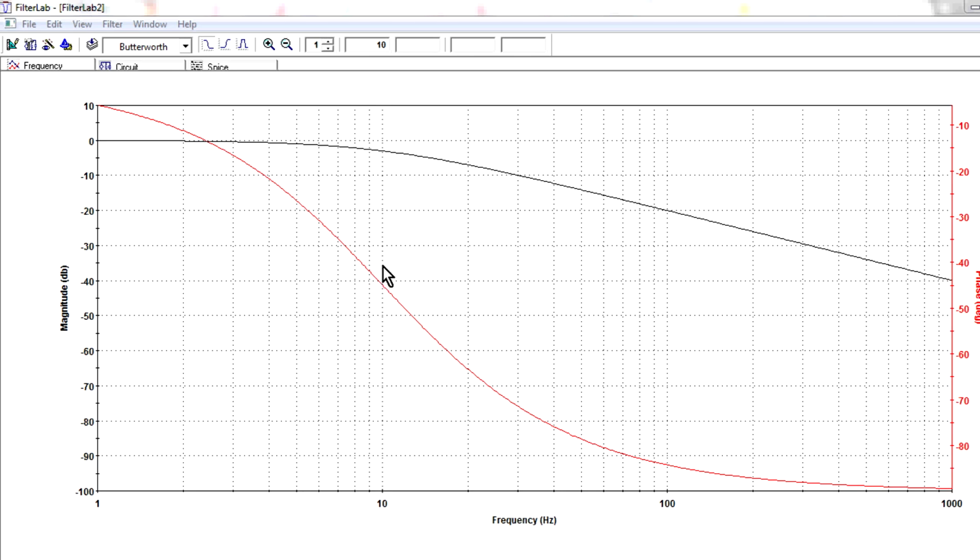It gets more complicated when you start talking about a PWM signal, and in practice it's actually going to be lower than that. But let's use a ballpark. Let's say you did actually get 1 millivolt of ripple out. Assuming it transferred to your output through the regulator, and there wasn't any extra further filtering, then that might be okay. But generally you'd want to shoot for better than that.